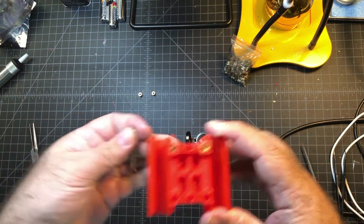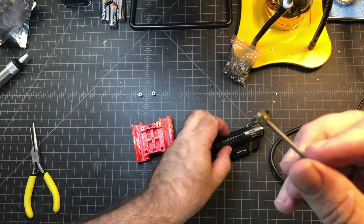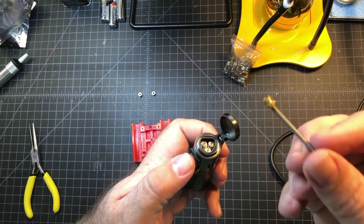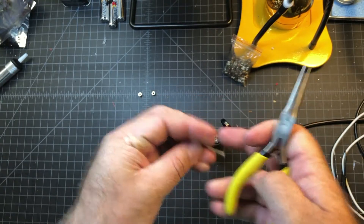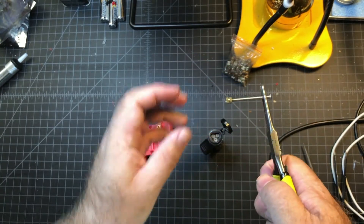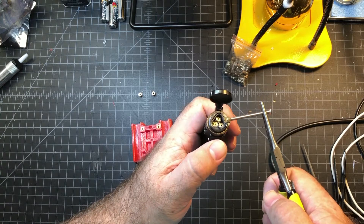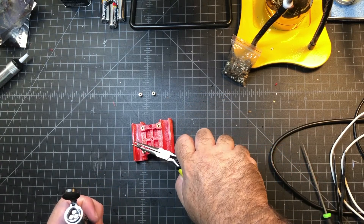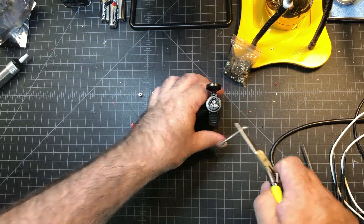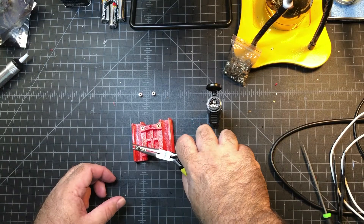The method I'm going to use is: you heat up the insert on the tip of a screw while holding it with pliers so you don't burn yourself. I light it for about 7 seconds — I found that to be the ideal time — then I insert it straight down, and use the screw to make sure it's nice and straight.